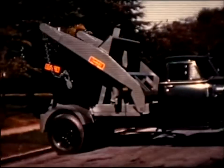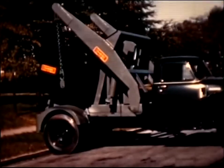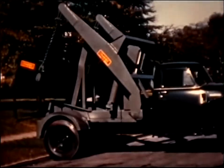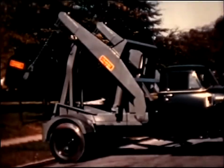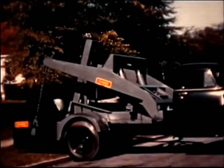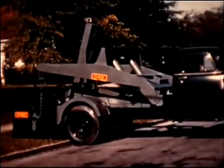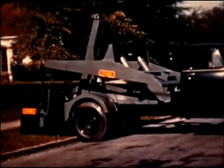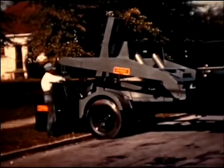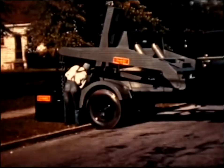In the same section of the city, a truck-mounted Dempster Dumpster supplies an empty hopper. Only one man, the driver, is necessary. With every delivery of an empty hopper for the Elgin 81D, he takes a loaded one to the dump. The driver steps out of the cab, unhooks lifting chains, removes boom rests, and proceeds to service another hopper. This driver and his Dempster Dumpster also services other Dempster Dumpster containers built for handling bulk trash and rubbish at business houses, hospitals, schools, apartment and housing areas, markets, and so forth.